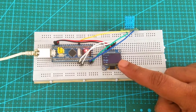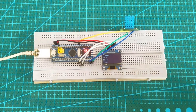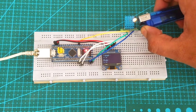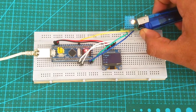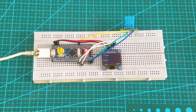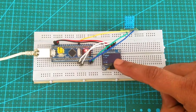While working on the STM32 and DHT11 based temperature and humidity monitoring system, I faced an issue where my DHT11 sensor was giving me 255 values for both temperature and humidity. I fixed this issue by replacing the DHT11 library. I searched for hours and finally found the correct DHT11 library which works perfectly with the STM32 microcontroller board. You can download this library from my website electronicclinic.com.